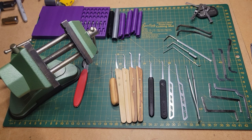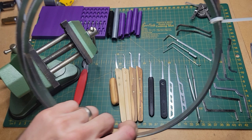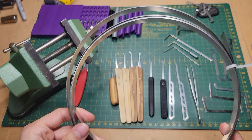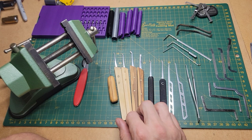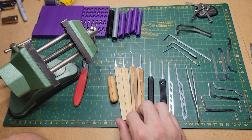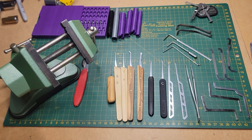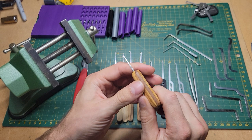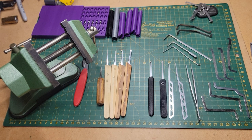Because I really had no picks and didn't feel like buying any - I was buying a lot of locks at the time, so a ton of money was going into that - I started making them. I bought nearly 10 meters of 19-thousandths metal, supposed to be 301 steel, it's not high yield but works pretty good. I made a short, medium, and deep hook, as well as a slider fork for the Desmo - you could also use it on a 3KS or something. I also made this little flag out of a wiper insert for picking the sidebar on my Abus Ruko.